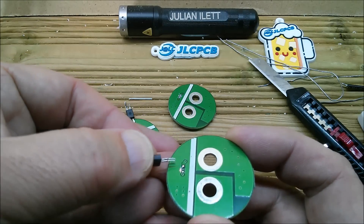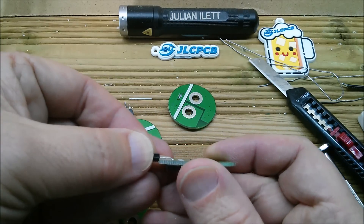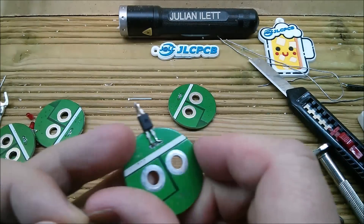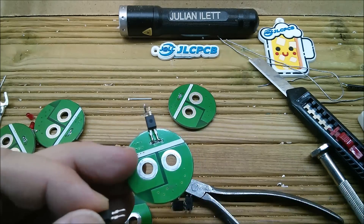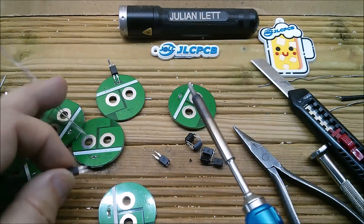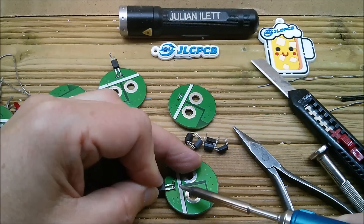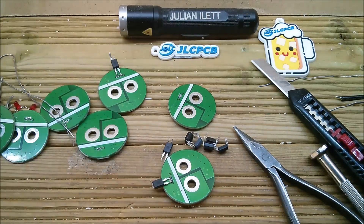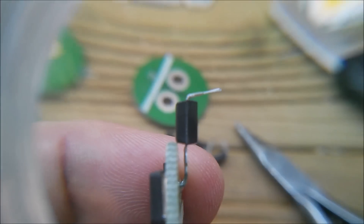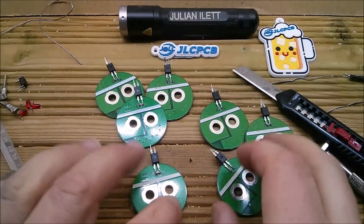Now I need to solder this on. I've slightly bent the two pins over right at their tips. I need to solder that onto the two pads I've made, leaving a little gap so it's not quite touching the board. On this one I dropped a bit of UV glue on there after I'd soldered it just to anchor it onto the back of the PCB. I'll just tin these two leg tips so that I can tack them onto this board without needing to hold the reel of solder. Is that on? It's a little bit far away from the board — I just need to nudge that a little bit out towards the edge.